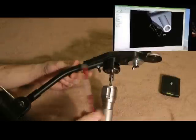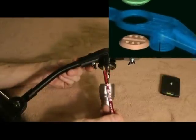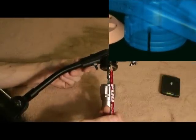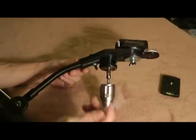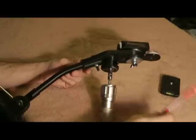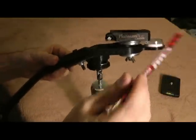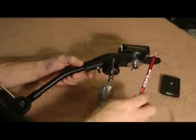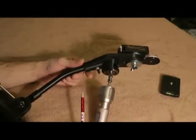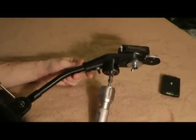Basic plate here, a little bend in it to accept the upper spar. Put a couple grooves around the bearing housing that you can see in the drawing to hold a couple O-rings for grip for panning purposes. Added a little shelf back here — this is one of the last things we added — to put a bubble level on it. It's a very important feature to have a level of some sort on your Steadicam. I like the bubble level because that gives me the front to back and the left to right balancing feature.